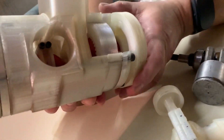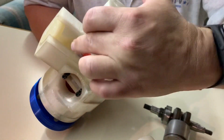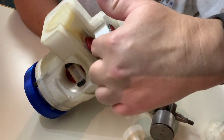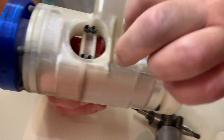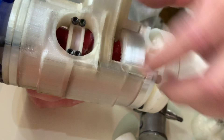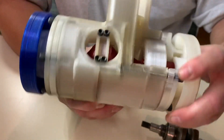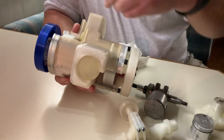When we set up all those geometry relationships together, we get a straight-line reciprocating mechanism. This elongated journal rides on a cylinder that transects the crankcase all the way through. The cylinder is cylindrical down here, but in this region it's machined away — narrowed down to only the width of the elongated journal in this section. You can look down into the crankcase and see how that's supported. It provides support for the crankshaft, provides lubrication, and provides support for the adjacent cylinder.